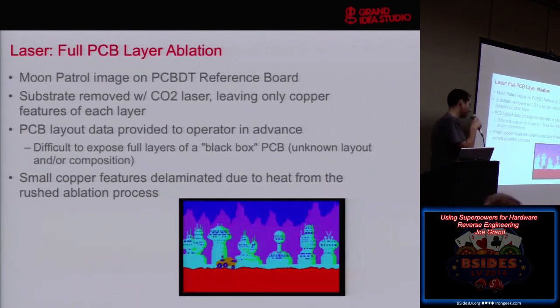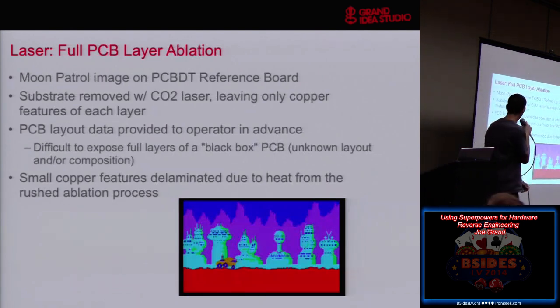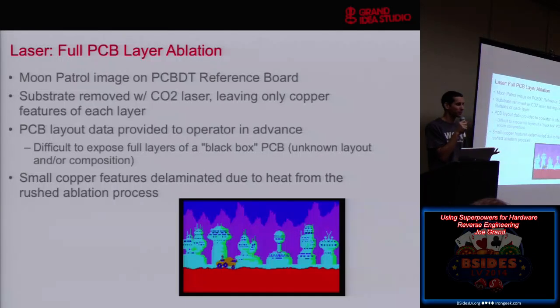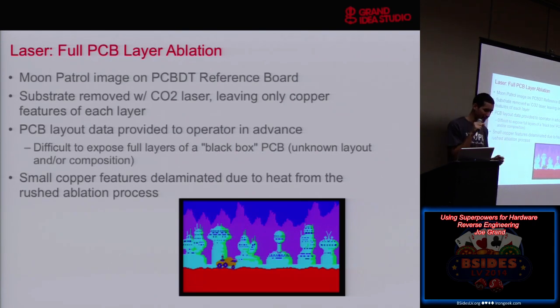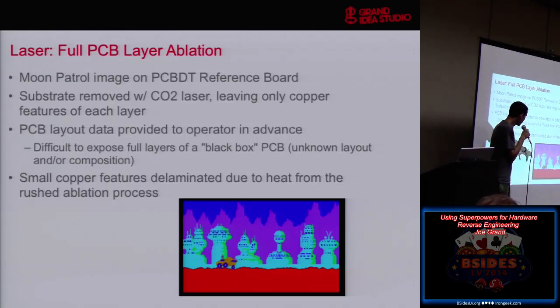Another really small space on the 10-layer iPhone board — you can see some super tiny traces, probably 2 thousandths thick, really small. The same sort of problem is that we can't really get discrete layer images. But what was really cool is what you can do if you actually provide the data to the operator. This is what this company specializes in — if they're doing rework, the engineer already has the documentation and says, 'I need to cut a trace on this layer, I need to access something.'